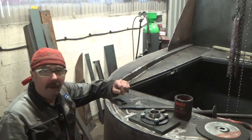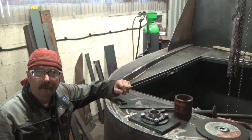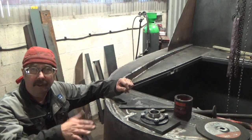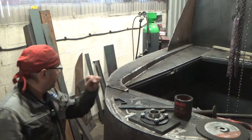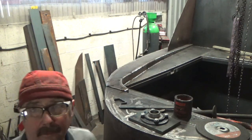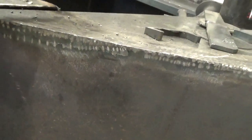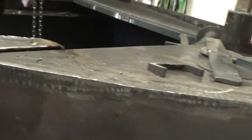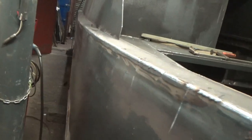This side's welded up, so it needs a good fettle now. Flatten all the welds off and we'll radius them, get nice corner radiuses on everything. We'll just have a quick look, but I'm not doing that tonight. There's a plate coming up here, vertical and across, to separate this from the engine, because you've got to put something to stop any diesel running in there. Anyway, it's all welded on, solid now.